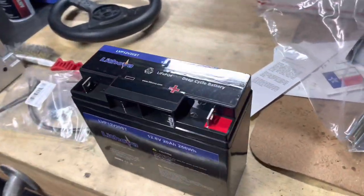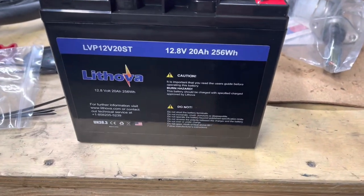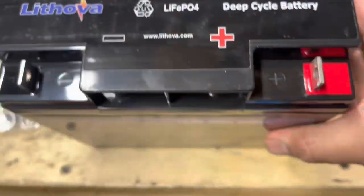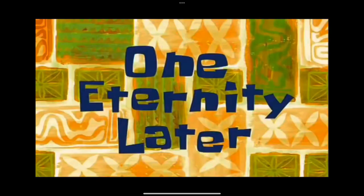Here's my 12 volt battery that I ordered off Amazon. Links to the product in the description down below. It is a 12.8 volt 20 amp hour LiFePO4 lithium battery, deep cycle battery. So I know it's going to be able to power my lights, no problem.